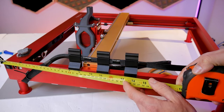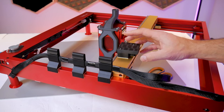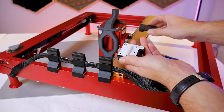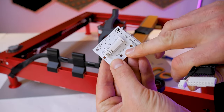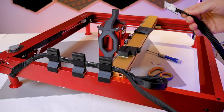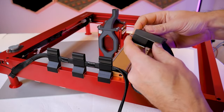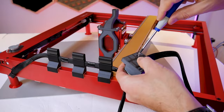If you have the X-Tool frame extension kit the dimension for the front stanchion will be the same but the dimension for your third stanchion will be longer. Next we're going to install what I'm calling the gantry routing block, which is going to route our wiring harness parallel to the x-axis on the gantry. I'll begin by removing the two screws from the top to release the cover and expose the PCB underneath. The PCB will have a label saying 'connector in' and this is where you'll attach the harness coming from the main board. It has provisions for the second connector for the 40 watt harness, but if you have the 10 or 20 watt just use the larger connector and ignore the smaller one. Place the PCB back on top of the plastic block using the locating pegs, put the cover back on, and put the two screws back in — making sure everything is sitting flat and properly aligned.